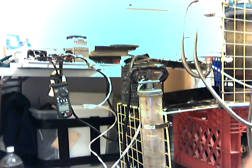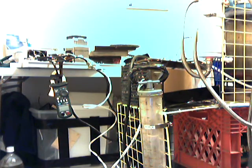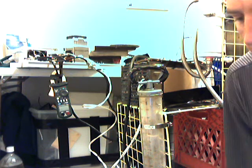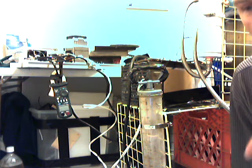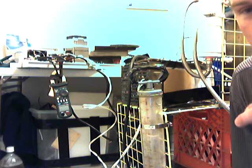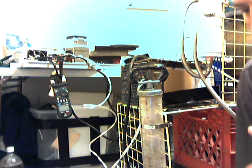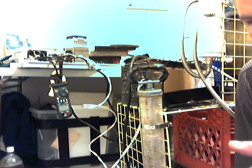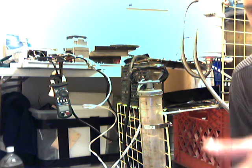I was running at 3.3 volts because I read in a chemistry book that 2.4 volts is where electrolysis starts, but using voltage that low doesn't work well — it just doesn't push the current. So now I'm up to 7.2 volts, and something really good happened: I seem to be producing more gas with less current — a double whammy.